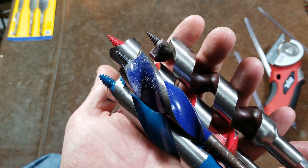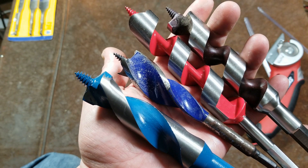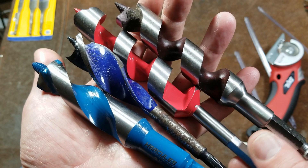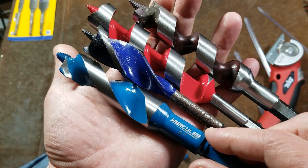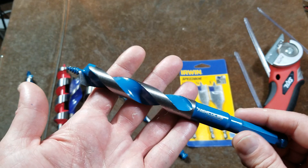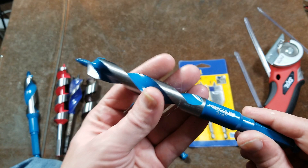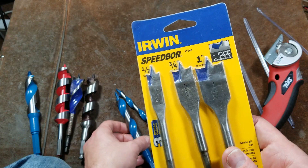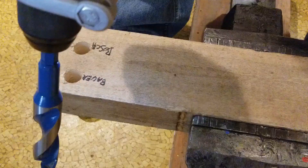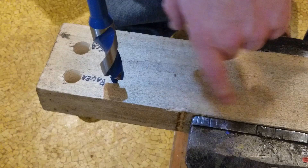The Hercules are nice but too expensive — 30 bucks for three bits versus 20 bucks for six Bauer bits with a 3/8 shank that works in most drills. Auger bits have a long straight shank designed to drill deep holes precisely because the shank keeps the bit running straight and true through heavy material. Unlike spade bits, auger bits are designed to drill far more holes before wearing out.